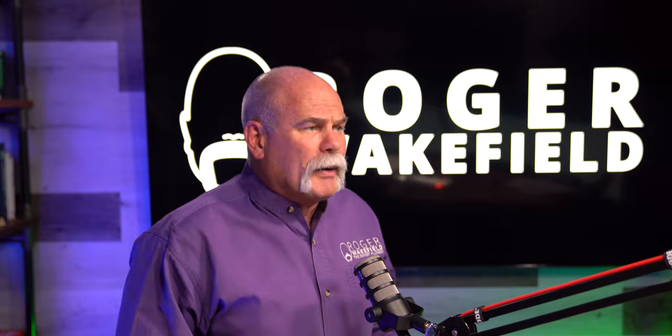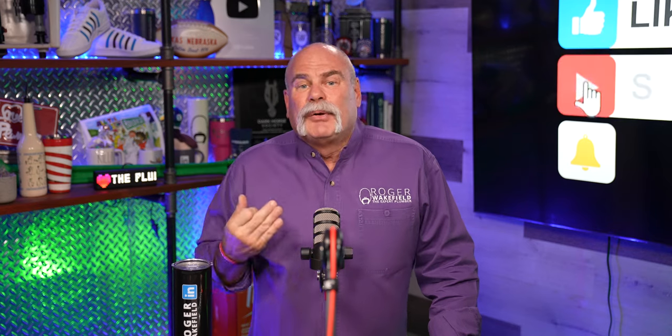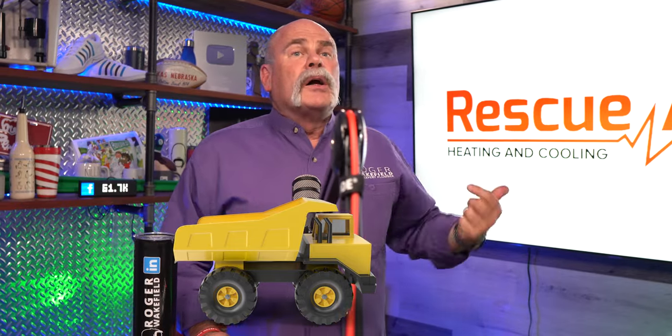If you're a plumber, you want to make sure that your water line or sewer line repair is anchored properly so they don't move it around. We've actually had that mistake in the past — we made a repair and the guys didn't put enough anchors in, so when the dig crew went back and packed it in, it actually pulled something apart. Then I had to pay them to go back and dig it up again to make that repair. You also want to make sure the dig crew is not hauling away too much dirt to make it look like they put more in than they really did. Look at it before they start backfilling and before they haul anything away, just to make sure.